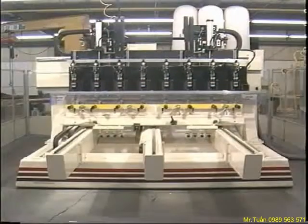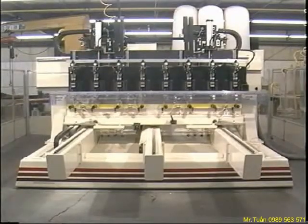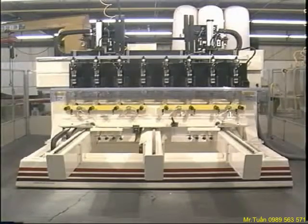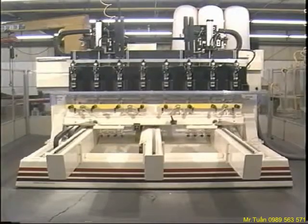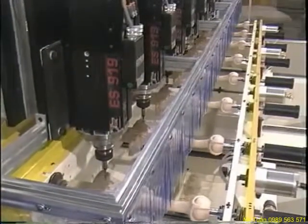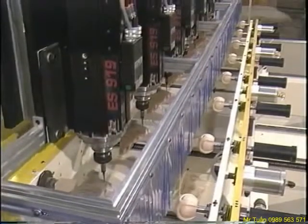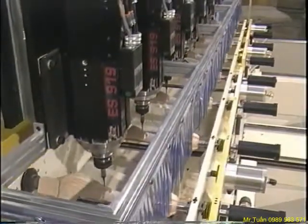The Model 80 is the result of over 10 years of experience with CNC carving. It's a rugged engineered steel structure that uses trackways and precision linear bearings. State-of-the-art digital servo AC brushless servo motors power the machine axes. It has eight 10 horsepower router spindles with variable speeds up to 22,000 RPMs, and up to eight different tools can be used in production with completely automatic tool changes.